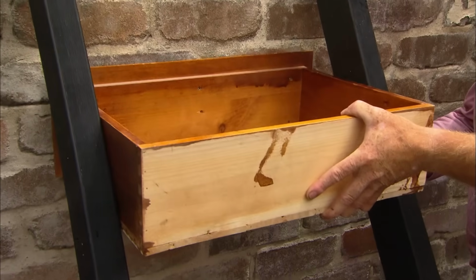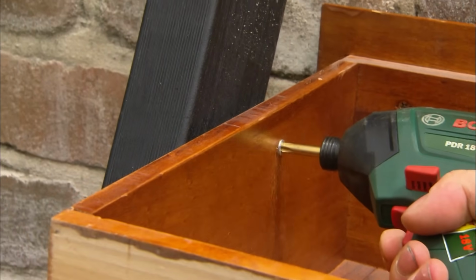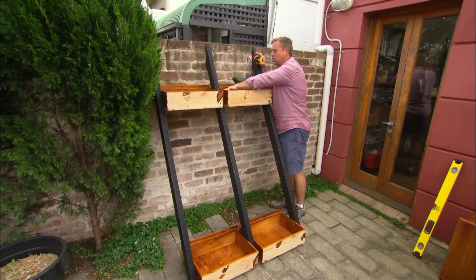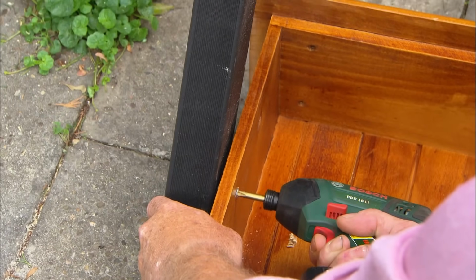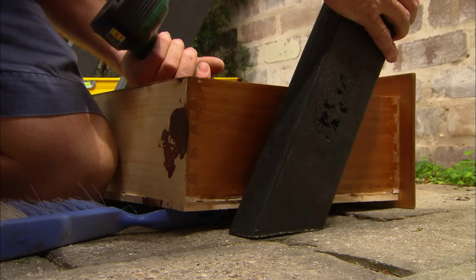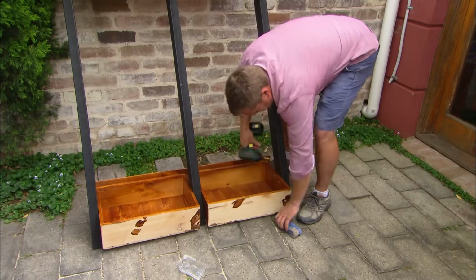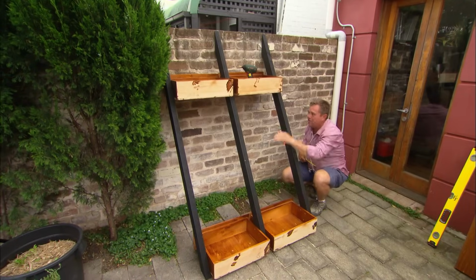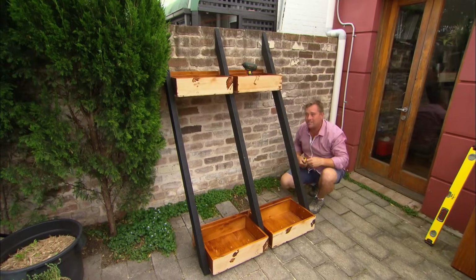When it comes to fixing the beds, the first one you do is the top. You need to work down far enough from the very top of the wall so that you're hitting the centre of the drawer. Then I'm moving on to the bottom and I'm coming just far enough off the ground that it's still low to the ground but free draining so the timber won't rot. Now I can run through there and my gaps here are nice and even.